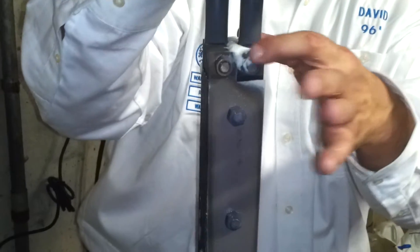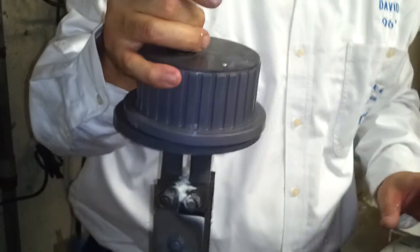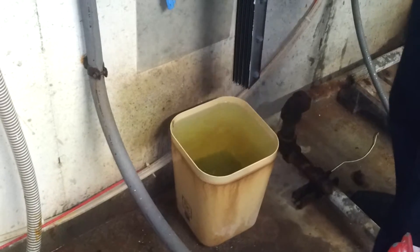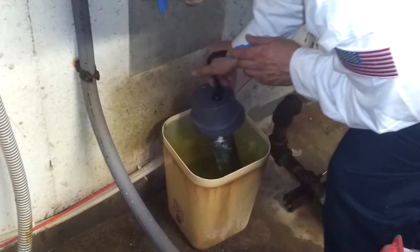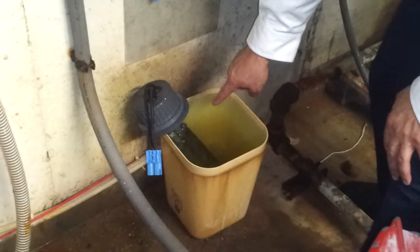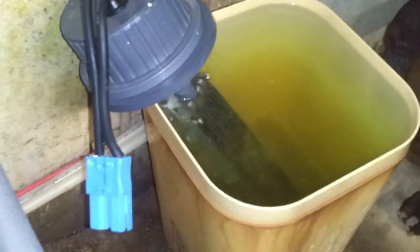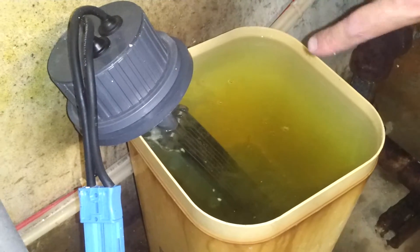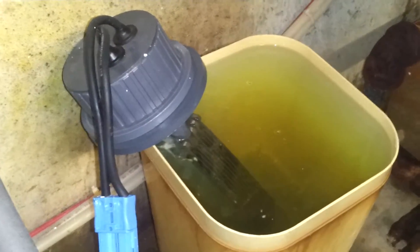Is that bad or just mediocre? I have seen worse, but this is mediocre. At this property I have not seen this much calcium build up on the top before, but for here this is mediocre. I have seen it worse at other properties, but not in this county's water condition. So we take these fins and use a muriatic acid and water mixture — the same concentration used when making a bucket of muriatic acid for the pH level — and just dip them into the muriatic tub. You can actually see all the calcium bubbling away. We only want to submerge the metal fins, not the plastic or any of the fittings. You can see it dissolving away — give it five to ten minutes. It's something you want to monitor and watch.